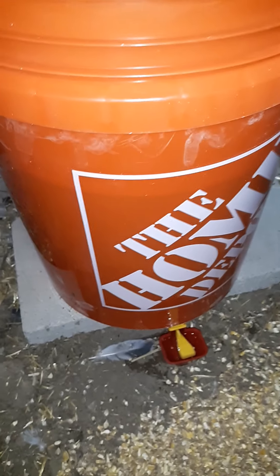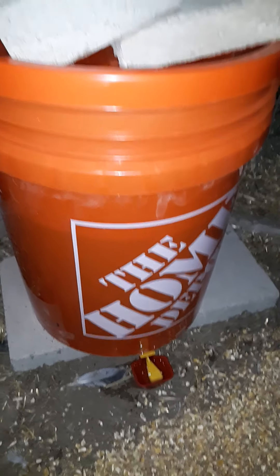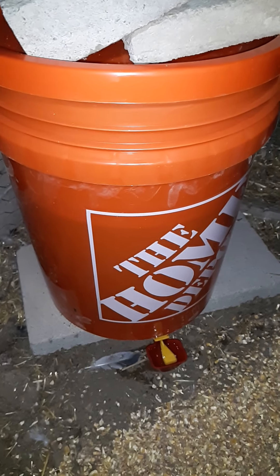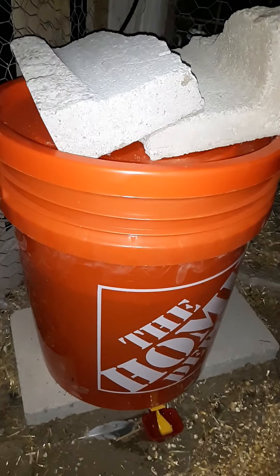This simple swamp cooler type line runs 150 feet. I run on a well with an underground pump house, which keeps everything from freezing. I have a 12-volt pressure-sensing pump running off a solar system — exactly like the type inside a camp trailer. I tapped this line into it and ran it out to the pig's pen, then teed it off from there over to my fowl pen.